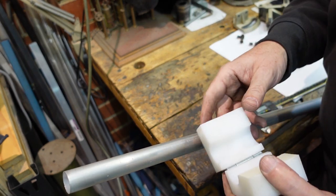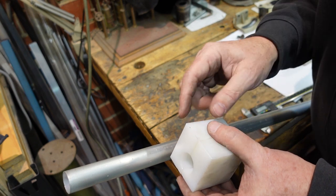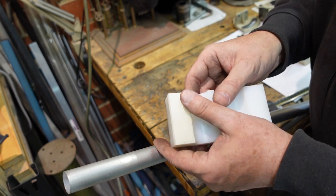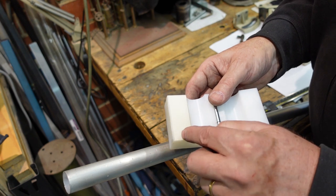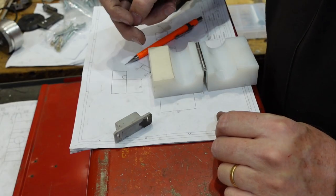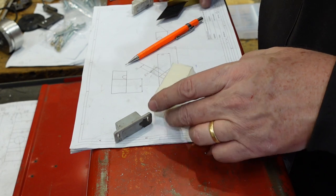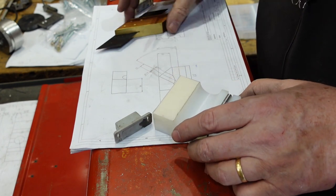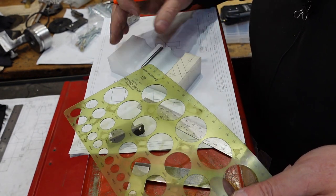I've finished boring this out and it grabs — it's what it should be. In hindsight maybe an extra layer of material would have been better, and it was slipping a bit in the lathe chuck. I've put masking tape on here and I'm going to plot out where my 16mm diameter hole is going to go, then put the bolt holes in and work out the hole tool approach. It'll need to go to the mill to get that hole drilled. A circle template in the workshop is handy — this is just another way it helps out.